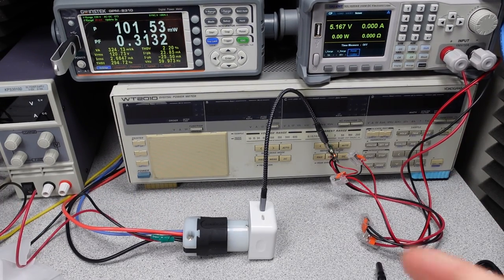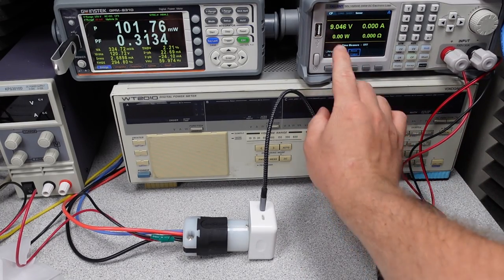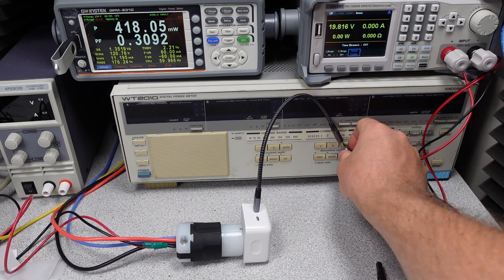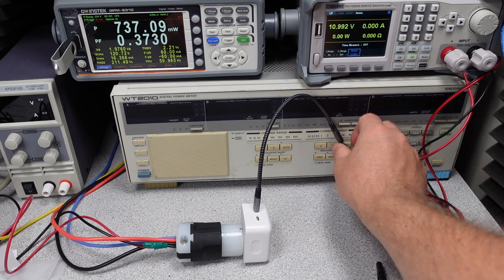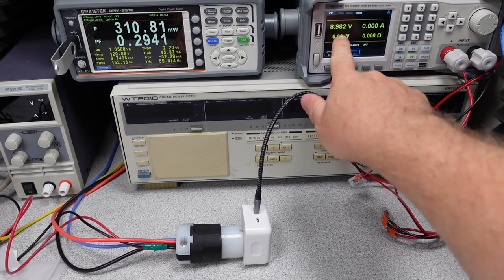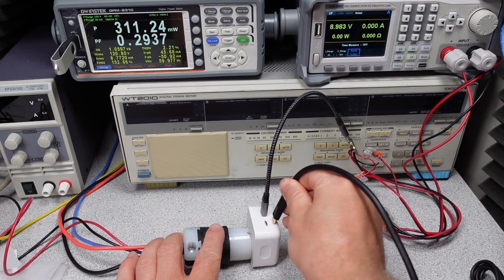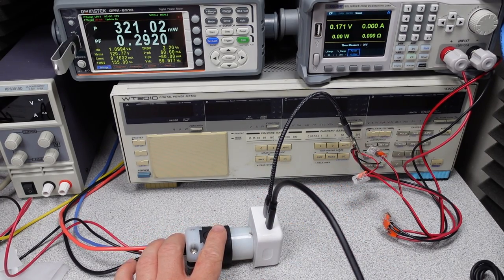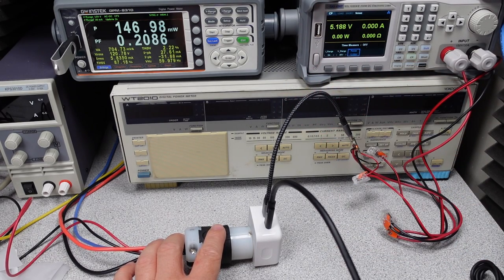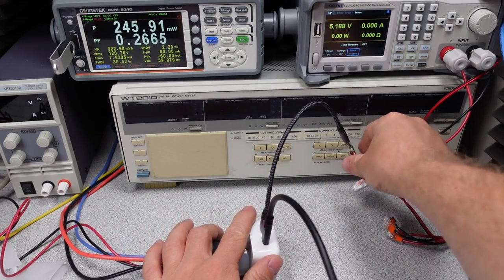With the USB cable plugged in, on one USB-C port we get 5, 9, 15, and 20-volt Power Delivery 3.0 modes — these are the fixed output voltages. The Kukat also has an 11-volt programmable power supply mode, which is a variable output voltage mode. The Apple device appears to operate as intended when switching between the various ports, meaning on each port plugging or unplugging it resets, and it does recover quickly and allow for renegotiation of a higher voltage level. The Kukat seems to behave a little differently — sometimes it resets and sometimes it doesn't.